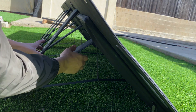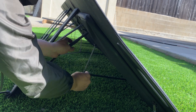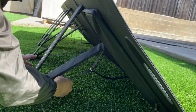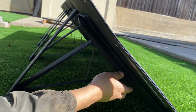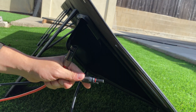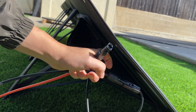On the back you'll see the adjustable straps and an additional brace against the solar panel for sturdiness. Move the straps and adjust as needed to get the right angle. Then unzip to get to the MC4 connectors — I have an MC4 extension cord — and just plug in the positive and negative; they snap right in.